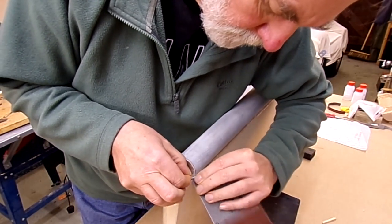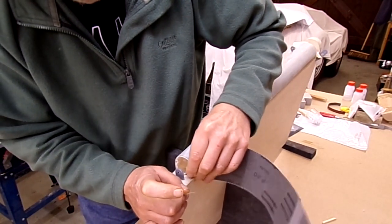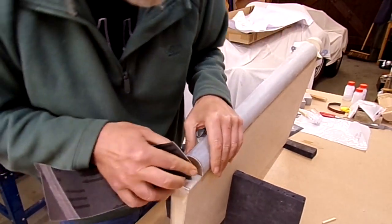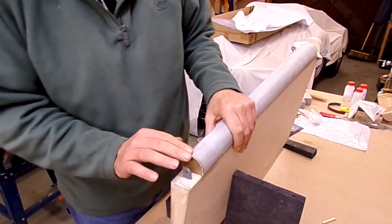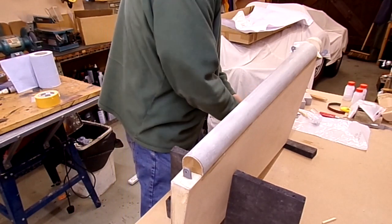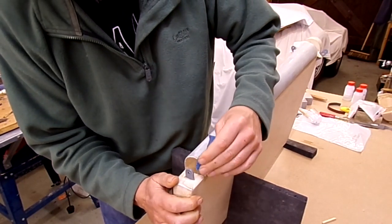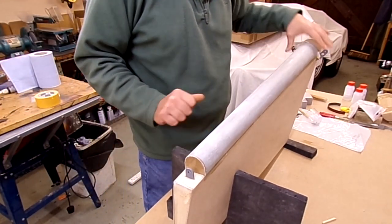A good method I've found in the past working with models. A nice gentle sand. And that gets rid of that. You don't have any sort of sharp edges that you sometimes get. I'll just go around it with a slightly finer sandpaper just to put a very slight chamfer, but we don't have any hairs on there. I'll do the same at the other end.